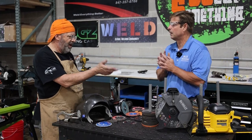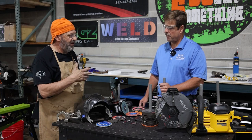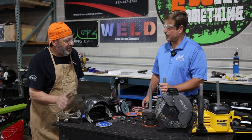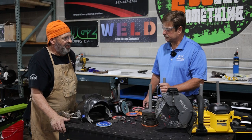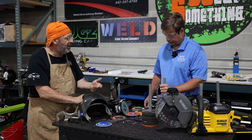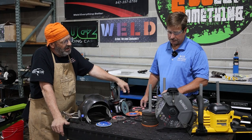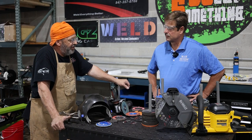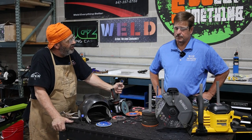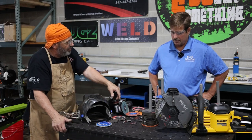With the advent of battery-powered tools, I've got two four-and-a-half inch cordless grinders — I keep one with an eighth-inch wheel and one with a wire wheel for buffing the inside of pipe root passes and interpass cleaning. I walk around, do my demonstrations — bang bang bang — and if I need to change, I'll put a heavier grinding wheel or a flap disc on quickly. That makes it safe, fast, and clean. Also take care of your abrasives — store them flat, don't throw them in the toolbox getting banged up, especially cutoff wheels.